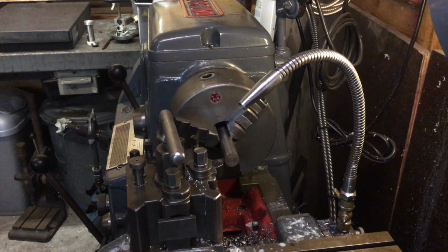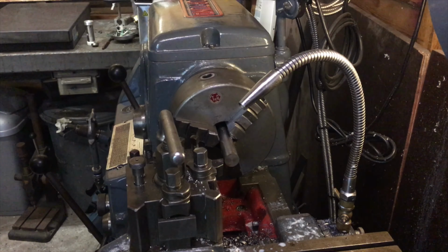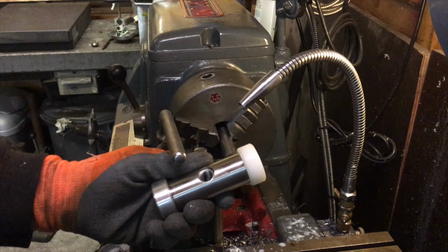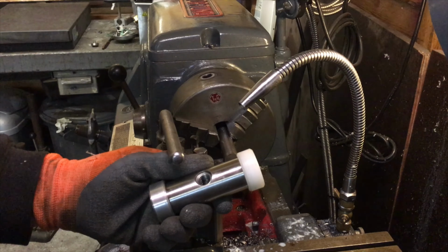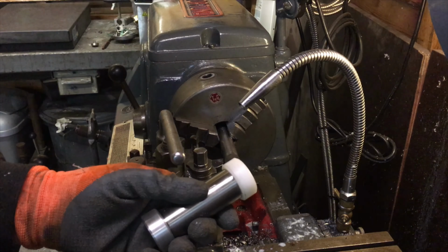So I changed the stock and the tool post. And this part I need to single point thread 12. So I'm aiming for a dimension slightly under 12. So 11.8, 11.85. The outside dimension, where's the head of the hammer? Yep. It should end up fitting in here, and that's about 15.7. So I'll do this one in one operation and then single point threads and see if we hit the dimensions right so the handle fits.